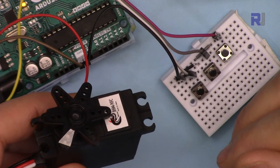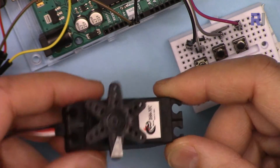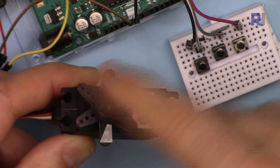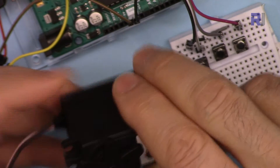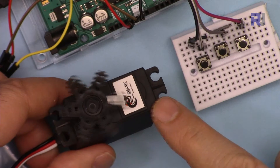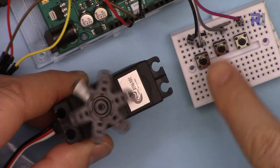You can replace these push buttons with a signal or whatever other means you have. This looks like a regular servo but it is actually a continuous servo, or sometimes called a 360 servo. As you saw with the regular servo going 180 degrees back and forth, this can run continuously either clockwise or counterclockwise. I have written and tested this code to make sure it works.